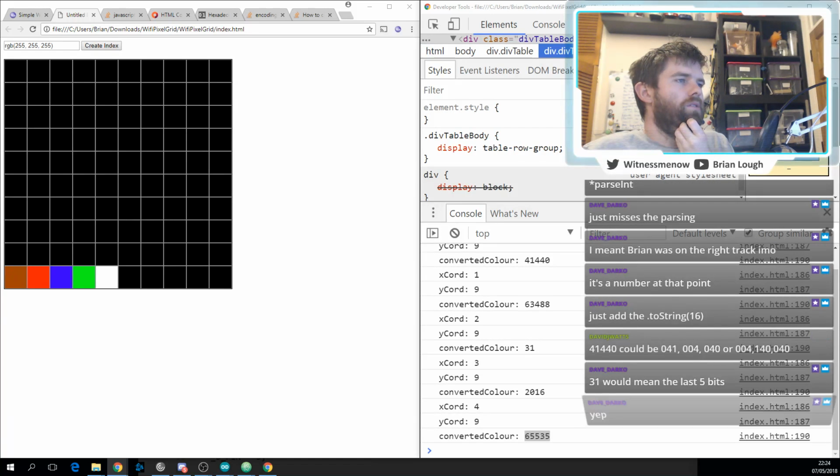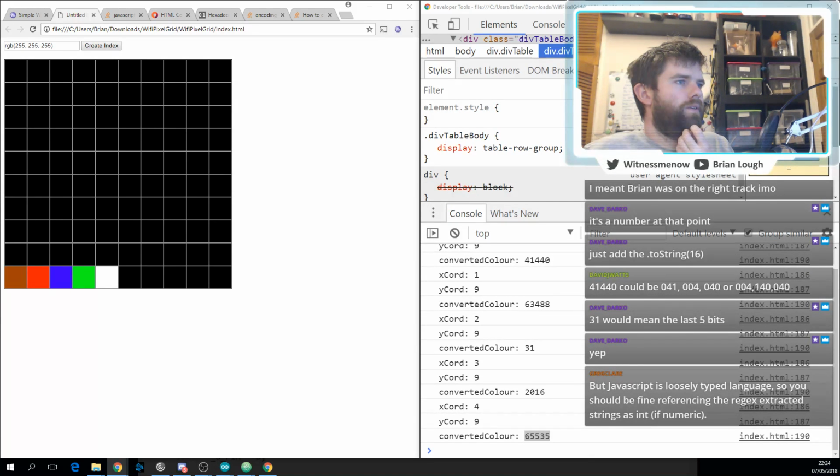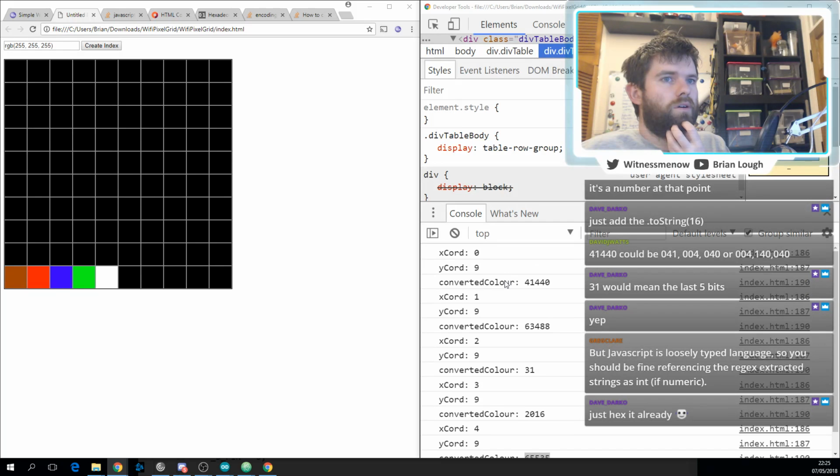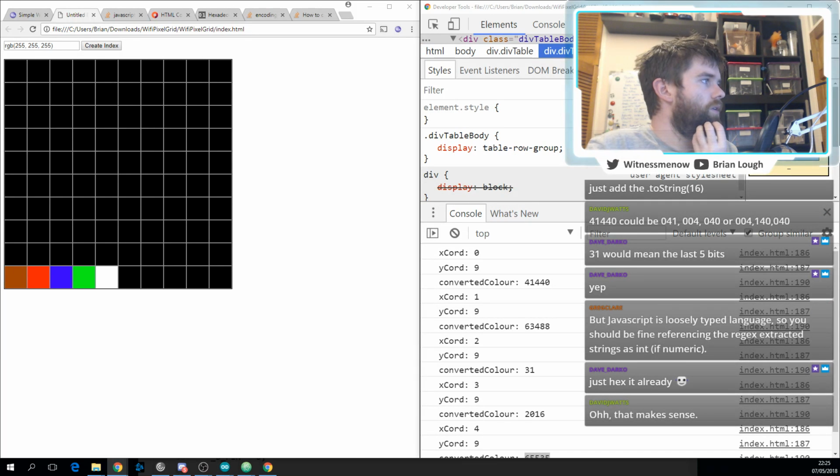Yeah, I think we're doing okay, to be honest. So white, 255 255 255, gives me 65535, which if you convert to hex is four Fs, which is correct. The red color, 63488, gave me F800, which is also correct. So I think we're okay.